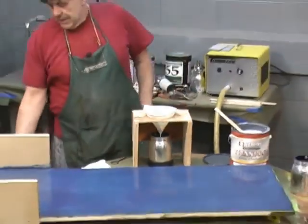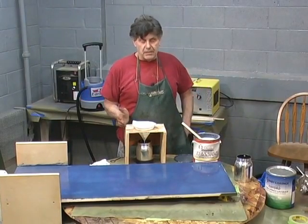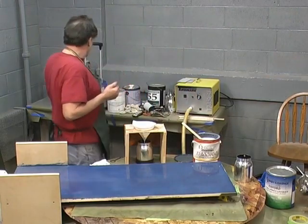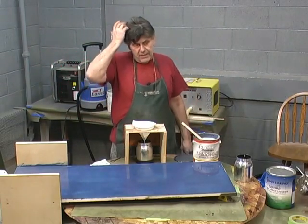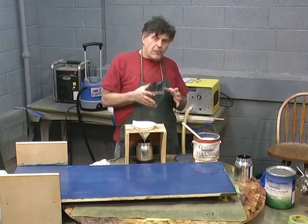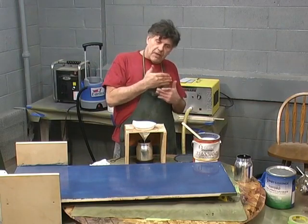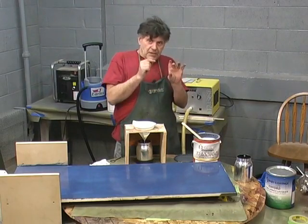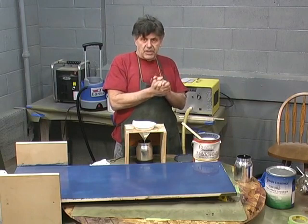Now the other thing we're looking at here is that there's a lot of hype out here about the two stages won't spray water-based paint or water-based finishes. Common sense says if the two stage will do it, the three and the four will definitely do it. The contention is that it's not enough air pressure to atomize it. What I'm telling you is that you could back down a size and needle. Again, it's like that finger over that water hose: pushing that fluid through a smaller orifice with the air, you can get the atomization. That's what we're going to look at.